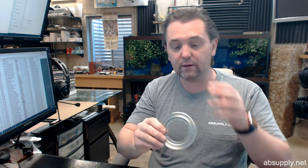A knob is not so much of a concern, but with a lever you can get unintentional rotation out of the lockset. You really want all of the design built into the rosette and the lock working to your advantage — the dimples of the lock going into the half circles, and these dimples biting into the face of the door one way or another.